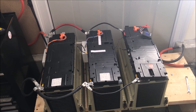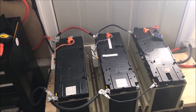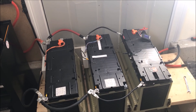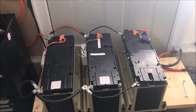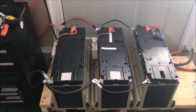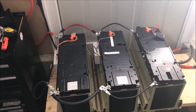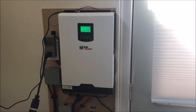There are seven total and you can see six of them here. They are wired internally to 24 volts, not 48 — they do come in 48 volt, and I'll make a separate video on how to do that. It's not an easy process, and I should say it's a pretty dangerous process. The two on the left are brand new batteries and they're producing roughly 3.3 kilowatt-hours.